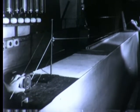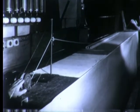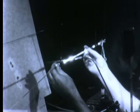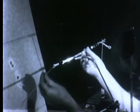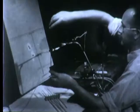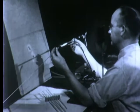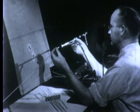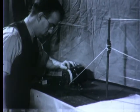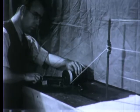A 17-foot wire track is stretched tightly on a long bench. At one end is the quartz rod, at the other a small high-speed motor. The quartz rod is supported in a light two-part carriage, the left half of which is arranged to slide up the track like a shuttle and guide the left half of the rod as it is pulled away. Note also the string attached to the end of the rod — that is the pulling cord, which runs the length of the track to a reel on the motor, which can be started and stopped very quickly by means of a push button.